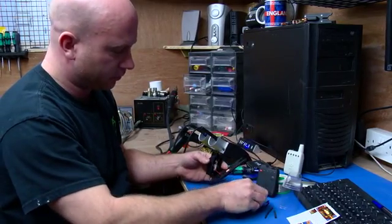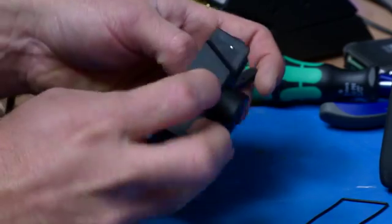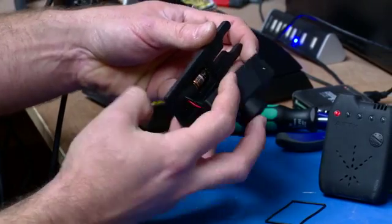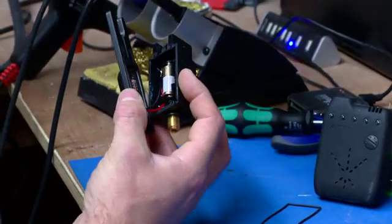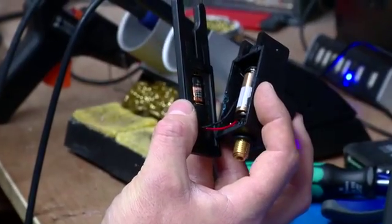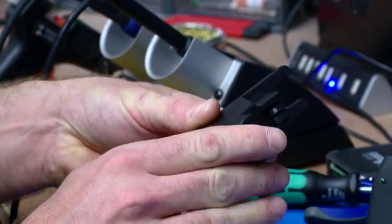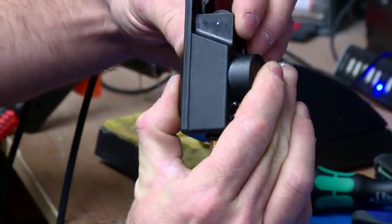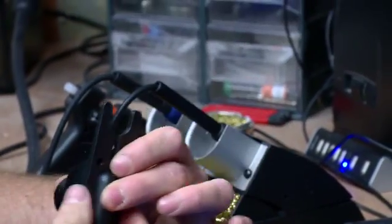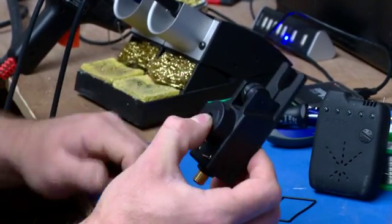So fitting the gasket, just feed that over the back and round. There you go, that's in there. When you close the back on the alarm, let's turn that off so you can hear me. When you close, make sure the wires come down and round the battery that way, because the antenna runs in the back, so you want the wires going down the alarm. It's only a rule of thumb worth noting with this. Hold that into place, and you can see, very unobtrusive, you've got a watertight seal all around the alarm. Then it's just a matter of refixing the 4 screws. Job's done. Do you know what, that's so simple, I reckon even I could manage that.